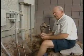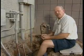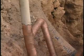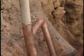When we heat this up, the gas is going to expand and create some pressure in the pipe. We need to have a way for this to leave and escape so that we don't have bubbling of the solder and create a leak.